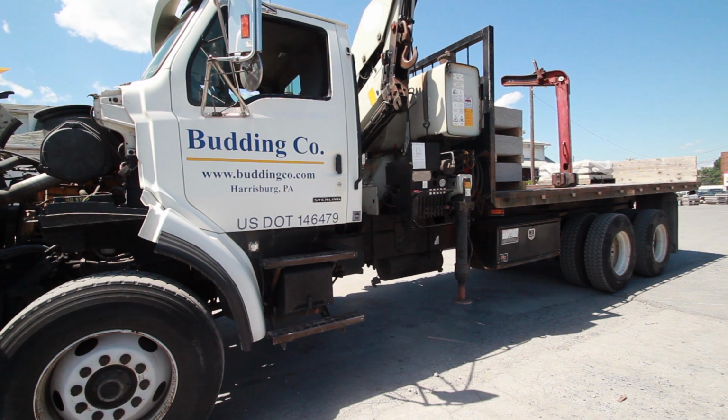You're not perfectly lined up. I mean, the outrigger is out over there, but it's kind of hidden a little bit. So everything you should do from where you're standing so you can see when you actually lift it off the bed, and make sure there's nothing coming by.